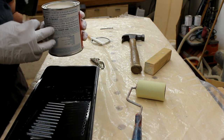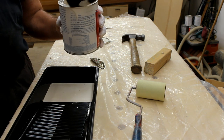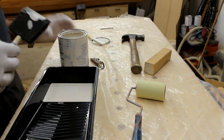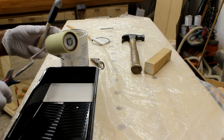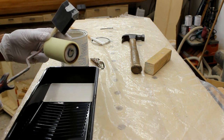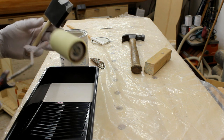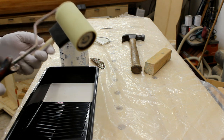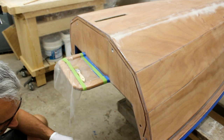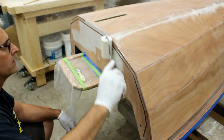So I've got a brand new paint tray. We're going to splash a pile in there and clean off the edge as best as possible — with the holes, excess paint will just go right back into the can. I'm going to use a very small nap roller, the same rollers we use for epoxy. It is much better to put on multiple thin layers of paint that will not sag or run than trying to put on heavy coats trying to fill the color all at once. I'll also do a bit of tipping off with the foam brush. I want to make sure the roller is fully saturated but I don't want to put on too much at once, so I'll just roll a little here and there.